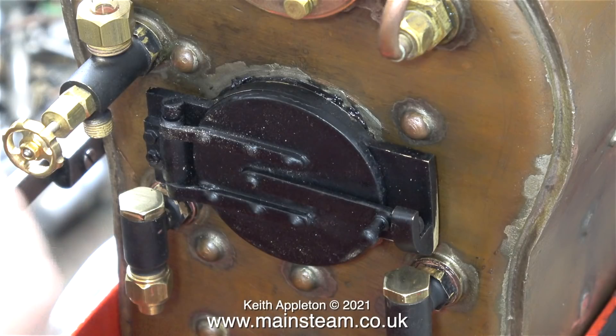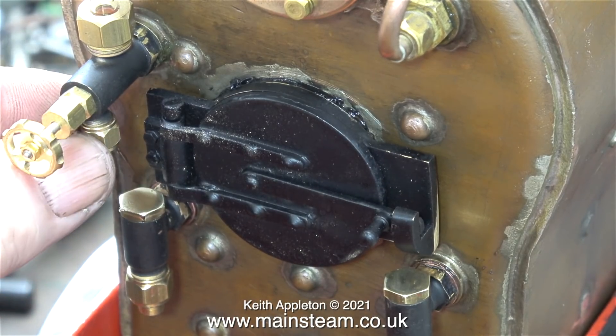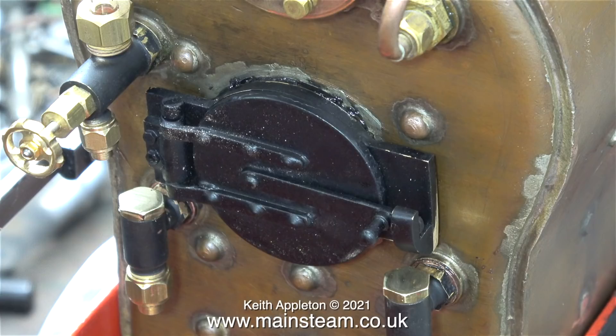Even after all that, I had to remove a very tiny amount of the brass mounting which holds the fire hole door. One viewer suggested making an extension for the check valves, but I don't want to do that because these check valves are visible when the engine is fully back together — they're above the level of the floor, which also means the piping from the check valves would stick out into the cab. Just the thing to catch pieces of coal.